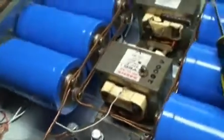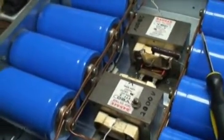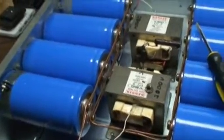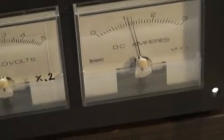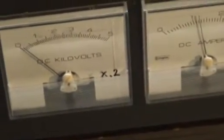So there's our current configuration. The diodes and resistors also work to prevent reverse EMF. Basically, after the thing fires, you have a kickback voltage and they help protect it. Somebody asked about the ammeter — the ammeter is now totally dead. It's kind of stuck at a number and doesn't respond anymore. But it only monitored the charging current, not the discharge current.